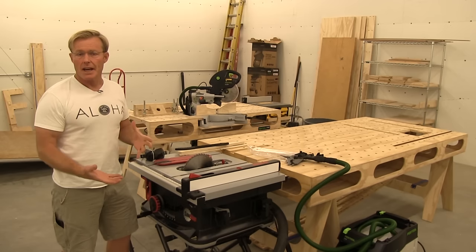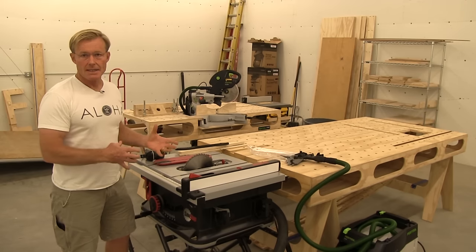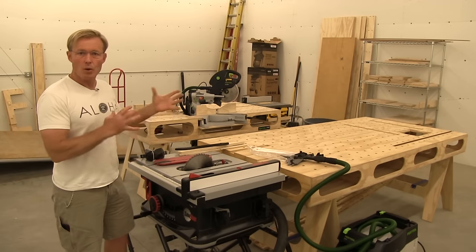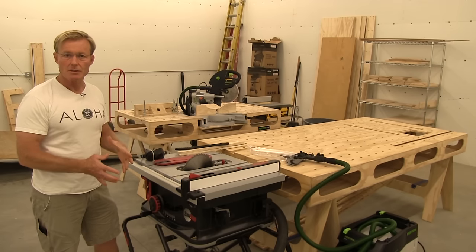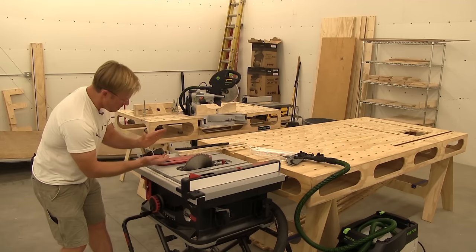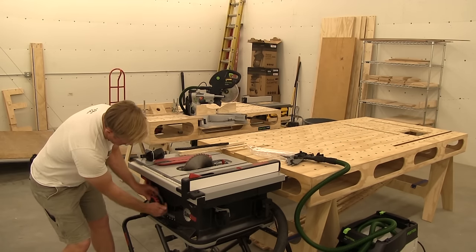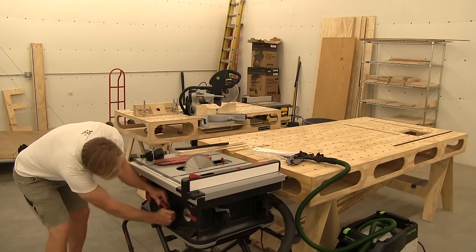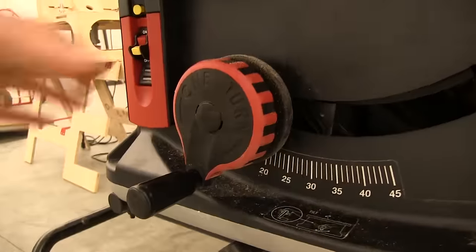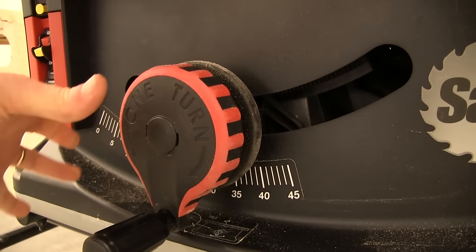In my workflow, I can't use a cabinet saw or big sliding saw — I do half or more of my work on site. So I either have to have a full portable set and a shop set, or make my portable set work in both applications, which is what I've chosen to do. To tip the blade, there's a disc behind the crank. You just squeeze on it and rotate it. There's a nice easy-to-read scale with a pointer so you can see right where you're putting it. Pull that disc and slide it back and forth — it's very smooth and locks right in when you let go of the disc. You don't have to tighten anything down.